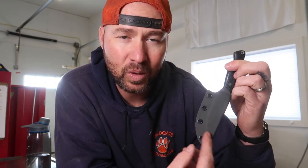But what if you're doing a wrapped-type sheath like this one? Obviously we've only got eyelets on the one side. So what I'm going to do is actually form this standoff in place. I just use a few pieces of scrap G10 and I tape them on here — it works really, really slick — and that will allow me to get this clip here in line with the blade. Rather than having to mount it off to the side, I can mount it in line, and depending on the knife, it gives you a better carry.